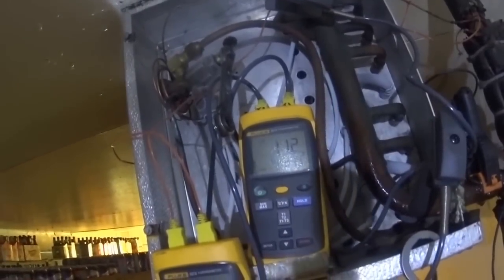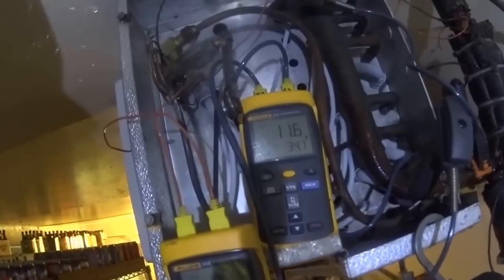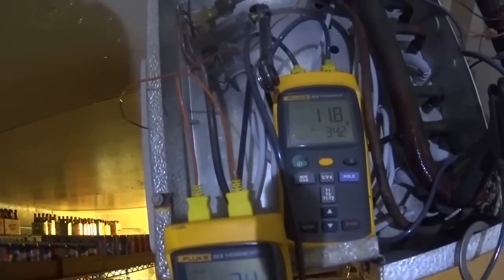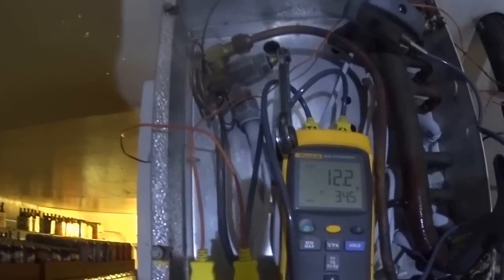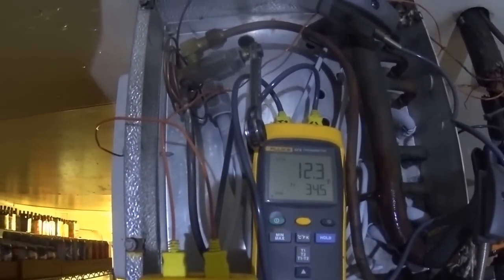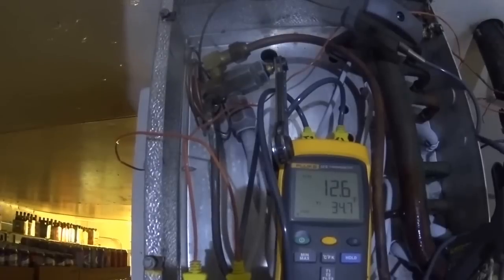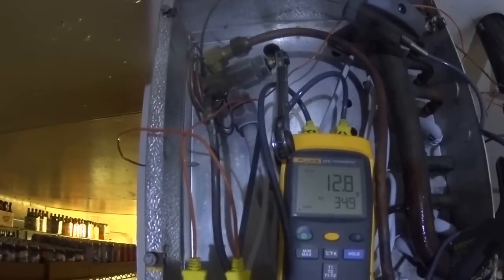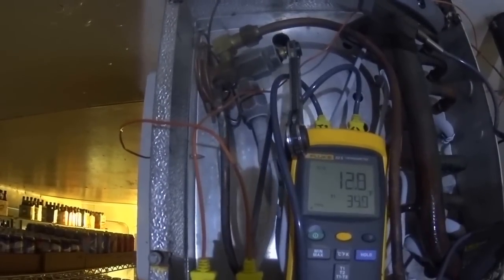It didn't drop down to minus one — that's good. I'm going to go up on the roof. I may have to take some gas out and that may affect our settings a little bit. The valve closed off now. It's rising a little bit. It's pretty stable actually, not swinging. Sometimes you get a valve opening and then closing and then opening — it drives you crazy.